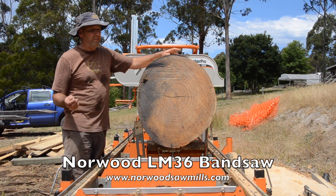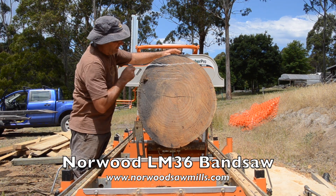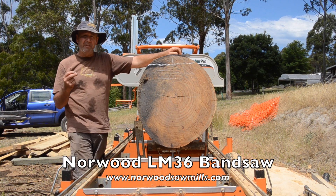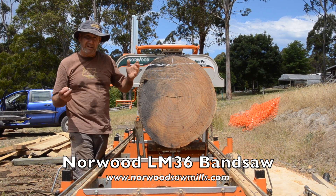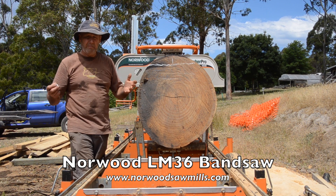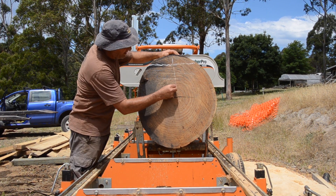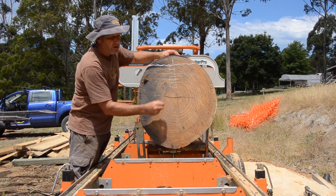What I'm going to do with the band saw is first of all cut across the top to take off the growth stresses. The aim of this strategy is to release the growth stresses which are inherently in the tree — even something this large has a small amount of them — and recover boards that are perfectly or near perfectly quarter sawn.